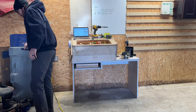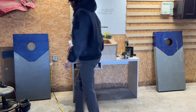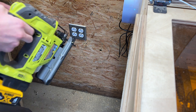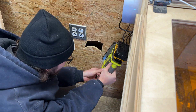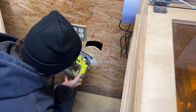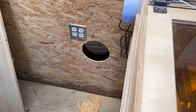The first thing you've got to do is figure out what you actually have to buy. I bought a six-inch fan, eight feet of six-inch hose, and a six-inch vent to go on the outside of my shop. Everything else came with the laser. I was lucky enough to get this from a friend who got a much bigger laser and didn't need this one anymore, so it came with the enclosure and the pipe on the left side.